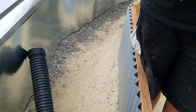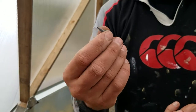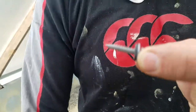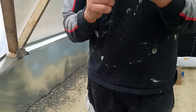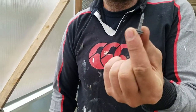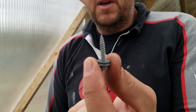Another important thing to know is the screws you should use to attach those: use sharp-point roofing screws. If you use ones with a little cutter on the front — called self-drilling — you won't get good penetration into the wood because they'll overbore a hole in it. So make sure you use sharp-point screws. I'd recommend inch-and-a-half; these are one-inch which are a little short, but inch-and-a-half is even better.